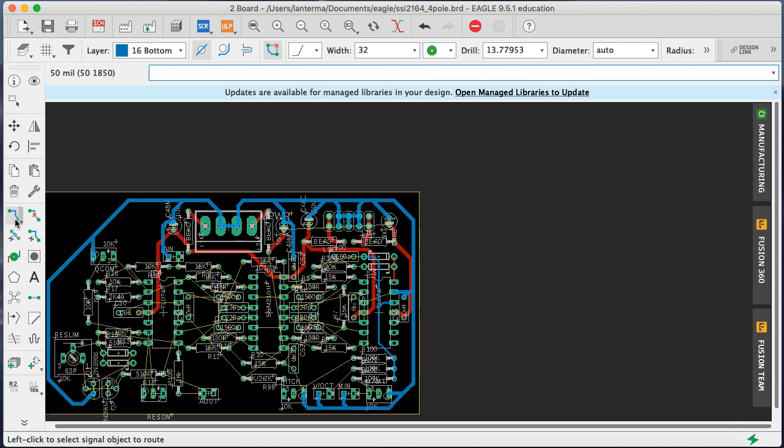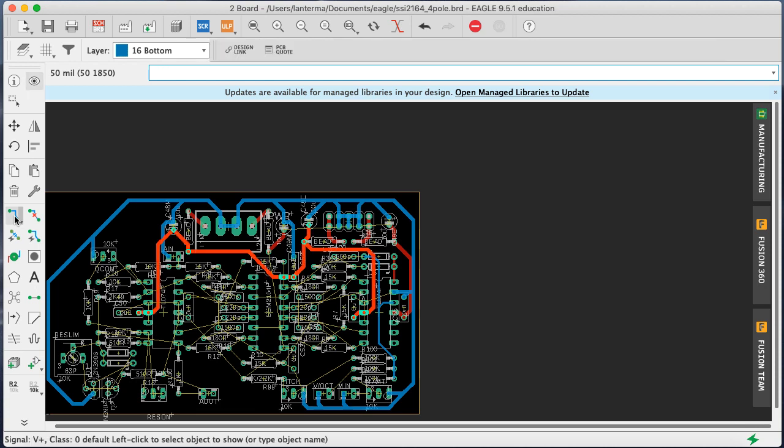That doesn't mean I don't use vias, and I'll absolutely use vias if I think it will give me a clearer, cleaner layout where I'm not going to Timbuktu and back. But if you have a bunch of vias that you're constantly crisscrossing on either side of the board, it can make it hard to follow what's going on. And if you spread out the traces a bit, it means that if you need to hack the board later, if you need to start taking an X-Acto knife to it or scraping off, heaven forbid, some solder mask to make a pad to solder a bodge wire to, you'll have some clearance. You have some space to do that.